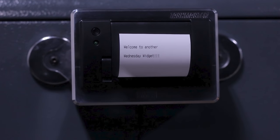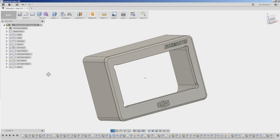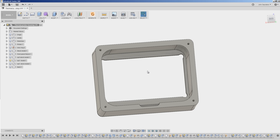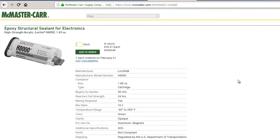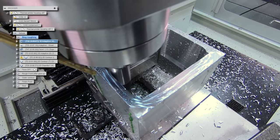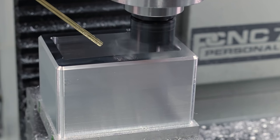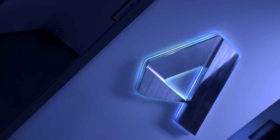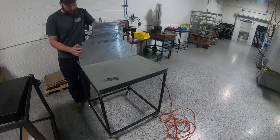Next up, machining the Arduino Taskmaster — one of the strangest projects we've done from a fixturing standpoint. To be honest, it may not exactly be correct to consider this a fixturing technique, except we wanted to make this box but didn't want to buy the material because such a high percentage of it was going to be machined away. So we used Loctite H8000 glue purchased from McMaster and glued inexpensive pieces of half-inch aluminum together to form a rough box, which we then machined down to finished size — and you really can't even tell it started as four separate pieces. We've used this same technique whenever we've needed a particularly large piece of raw material that may be prohibitively expensive, but you can make it work by combining multiple pieces into one.